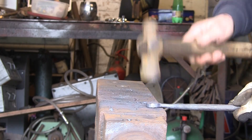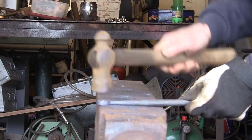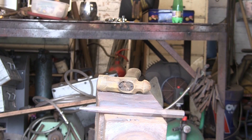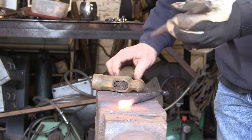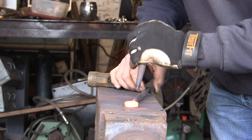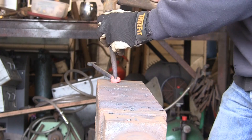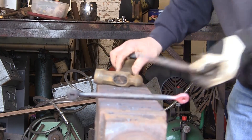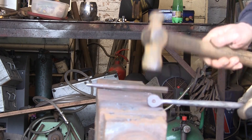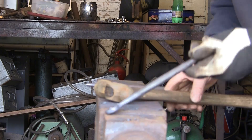That black mark is where it's come through - just give it a tap and there you go. You can see the bit on the anvil - it's popped out. Put it over the pritchel hole to make it slightly bigger and tidy it up. Nice little neat hole. I hit that punch one too many - I knew it as I did it when I felt it hit the anvil too much. Just enough and it pops off easily. If you're not confident getting the center by eye, put a center dot in before you heat it, give it a quick wire brush as it comes out of the fire and you'll see your mark quite easily.